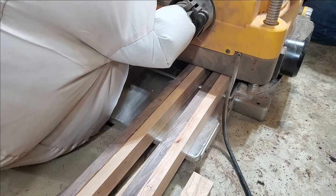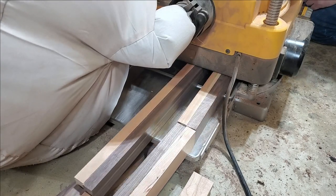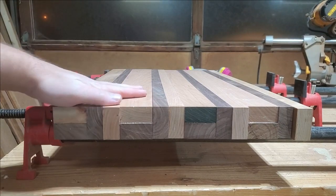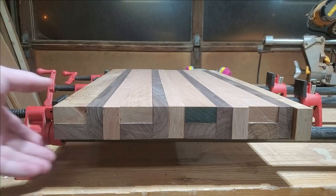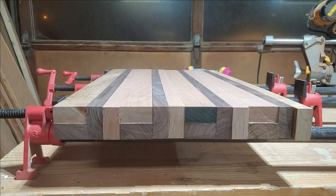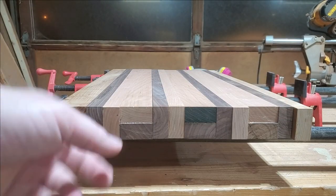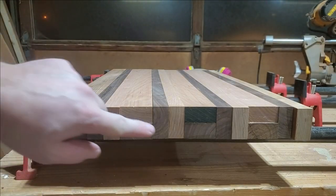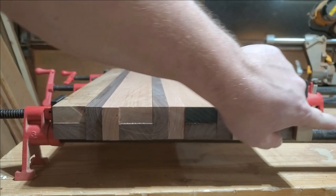All right, now we've got these things jointed and planed down to be perfectly square. We're ready for the next glue up. What we want to do is organize them this way: parallel, vertical, parallel, vertical, parallel, vertical, parallel, vertical. But you want them to stay in the same direction